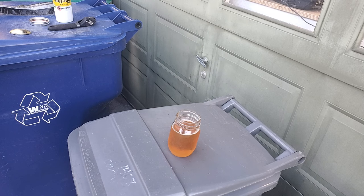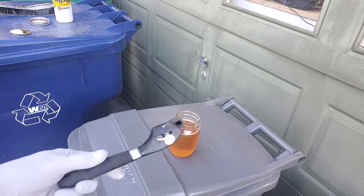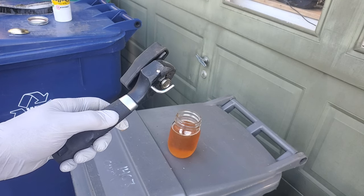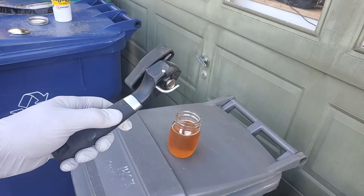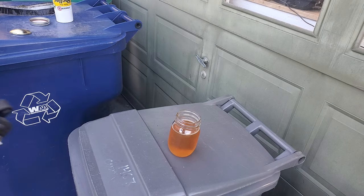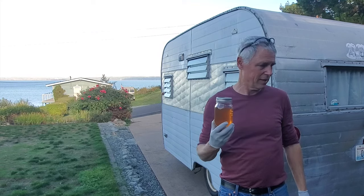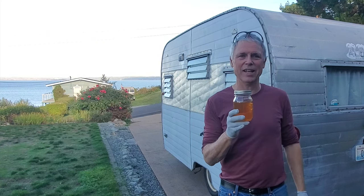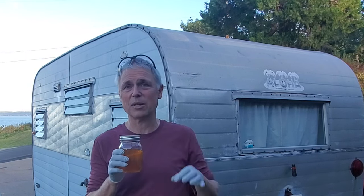That's how you decant a shellac can. You could probably do this with a paint can too. Just be very careful when you're using the side can opener — turn it very slowly. When you start hearing the pressure back off, let it sit a while, just let it leak out. Give it some time before you go and crank on it, or you might get sprayed pretty good. It's still cold actually — this is about 45 minutes after taking it out of the can. So I'm going to let this sit overnight and then do some touch-ups where all that mold buildup is. Hopefully that'll solve the problem.